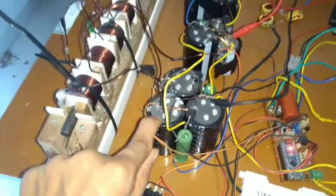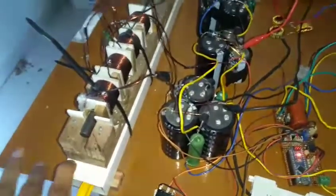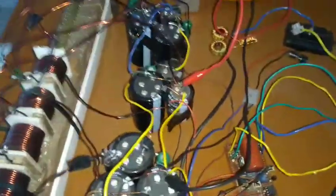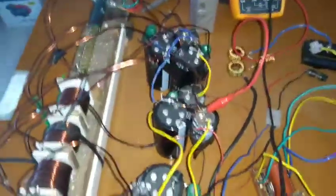Without this resistor, a lot of current flows through the circuit even though the capacitor has fully discharged, and that would suck back the projectile instead of letting it accelerate. So I have that snubbing circuit for all stages embedded on the capacitor bank itself to make it compact.